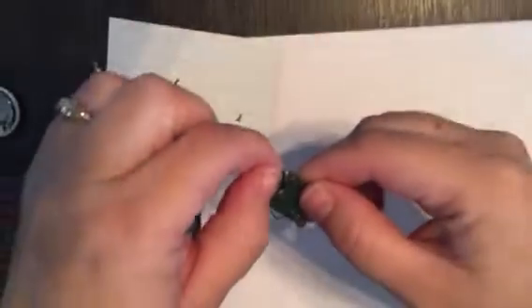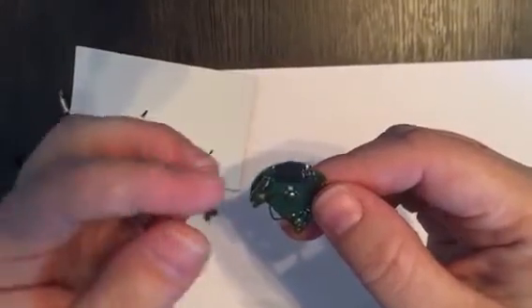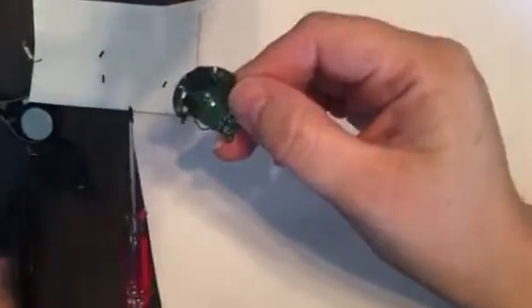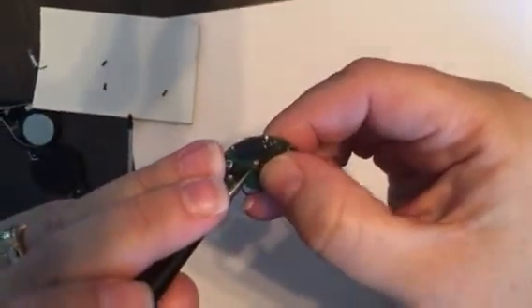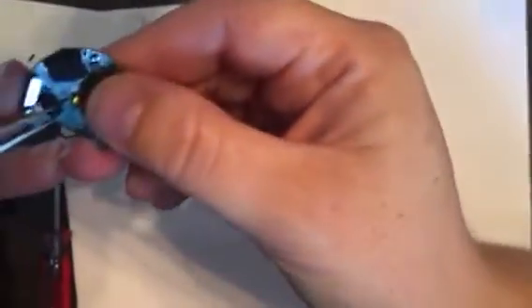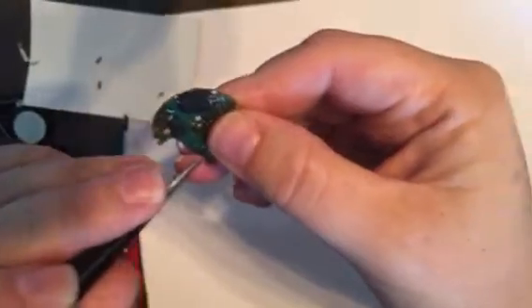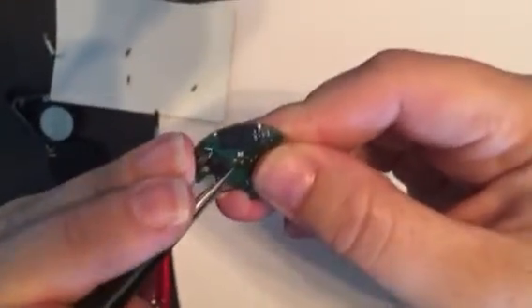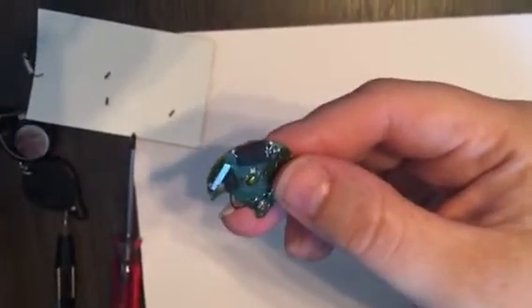Sometimes you have to readjust that a bit because you won't get the connection good. And I just take some of this black goop that they have up here covering up some of the other electrical things, and I use that to hold my wire in place so it's not bouncing around. I haven't really had too many issues with it ever disconnecting, but if you do, you can just readjust that wire. The point that you're looking for is along this top edge underneath. So every time it triggers the vibration motor, it's going to complete the circuit and act like you pushed the button. Your button still works, but yeah.